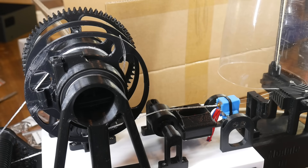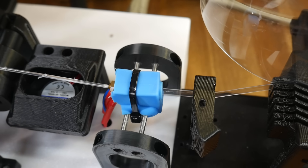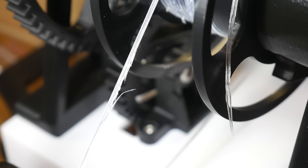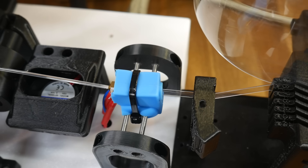From this point onwards, we have two things we can play with: the motor speed as well as the temperature. This requires a bit of trial and error, but it wasn't too long until I got a feel for it. If we have it too hot, we start to get cooked and degraded filament. So I found that sticking to a max of around 215 and slowing down the motor until the output was really clear and uniform was what got me the best results.